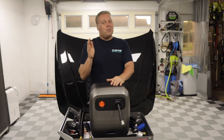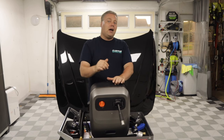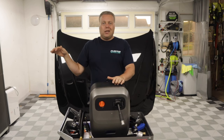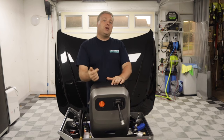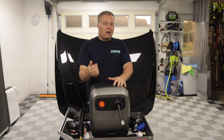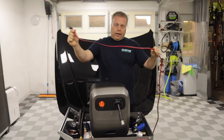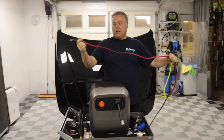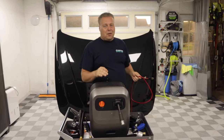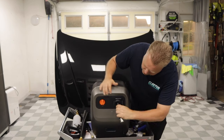Just about every person using an extension cord at home has a 16-gauge wire, which does not have enough capacity — the voltage drop rate is much higher as it gets longer, so you're not supplying enough power to the unit. Underpowering a motor can damage it and gives you worse performance. In this video we're using a big 12-gauge cord about 20 feet long. That's why many companies say don't use an extension cord — it's not that you can't, it's that people don't use the right ones.